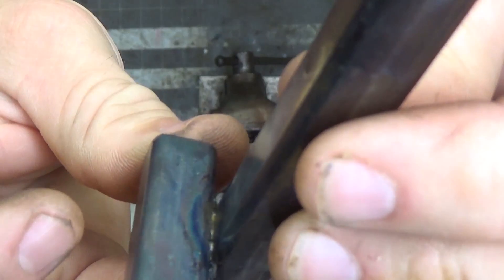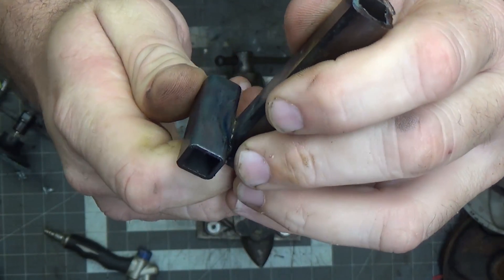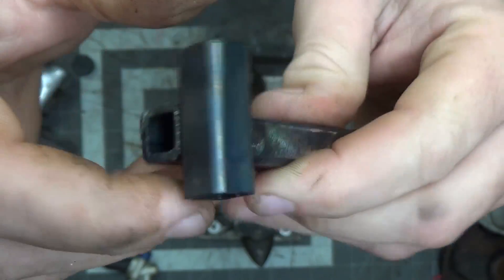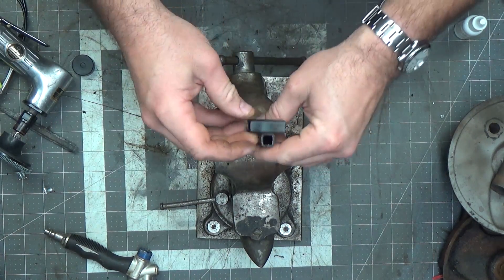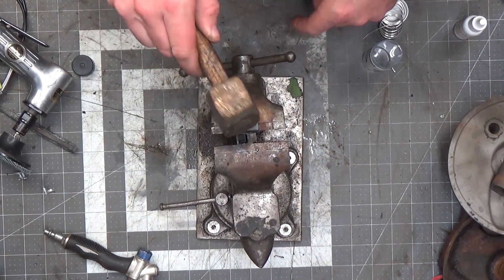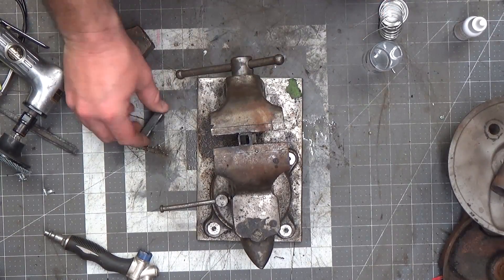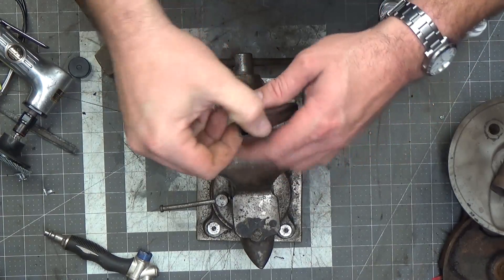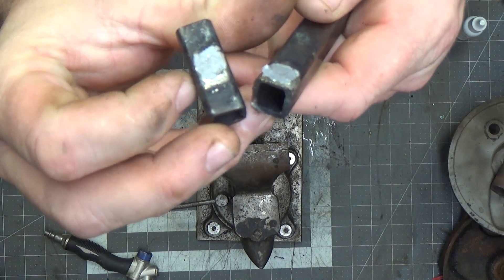Alright, so that's silver-soldered on there now. I didn't let it cool down on its own accord — I went and washed it in the sink real quick. The back side I could obviously do a little bit better job, but that's relatively strong. I'm not sure how good of a test this is. Ideally I'd want to sweat that other side back on there, but you can see it got pretty decent adhesion. It is relatively strong, but it did still snap off just the same.